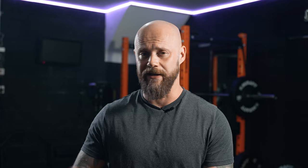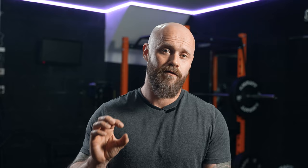When it came to preparing the floor, I researched a lot of different solutions, including epoxy resins and all different types of paint. I found a really good heavy-duty paint from Amazon for £48. It was a solvent-based paint with very strong fumes, so I had to paint in 15-minute bursts wearing a mask with the doors wide open. Because the garage still had lots of contents, I had to paint two thirds of the floor, wait for it to dry, then move everything over to paint the remaining floor.